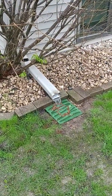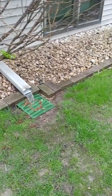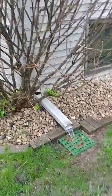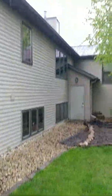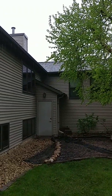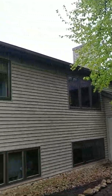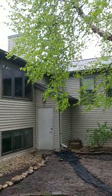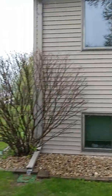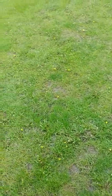For this downspout I'm trying a drain grate — just to see how it works. I'm putting in three drain grates total; all the rest go directly into the pipe. I'm going to experiment and see how it holds up to negative 20 or 30 temps again. If I have issues with any particular technique I'll fix it next year. I've also had ridiculous ice dams, so on these northern valleys I'm going to install heat cable. I've kind of given up trying to do without gutter guards — I'm going to put them on these back gutters.